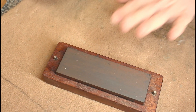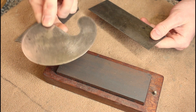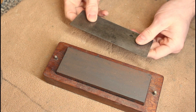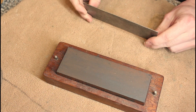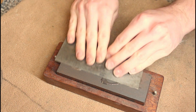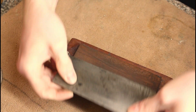I've got some different card scrapers here but I'm sharpening this simple rectangular one today. What we're aiming to do on the oilstone is polish the edge and get it to a perfect 90 degrees around the corners. It's very important that the stone is flat. I put some oil on it and now I'm rubbing it over the stone — this face, this face, this face — going through it repeatedly without applying very much force.